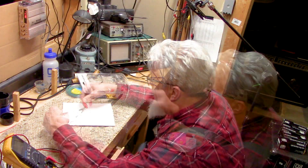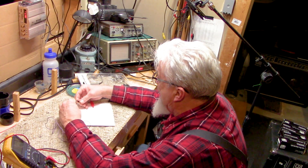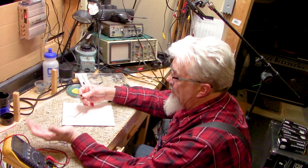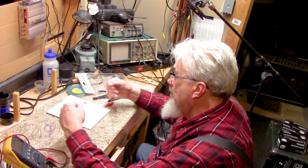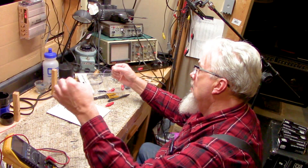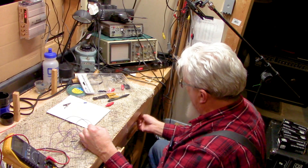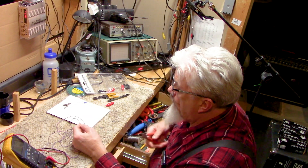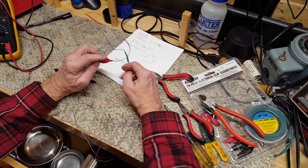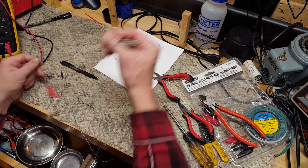Let's build the tool. For flexibility, I'm going to put the resistor in the middle. It might be easiest to hook it to one of the clips, but then I'm worried about bending it and eventually breaking off the wire. I'm going to make it about this long — for any chassis I do, that should be plenty to reach around. I actually finished the clip off camera; I was just soldering it together and heat shrinking it.